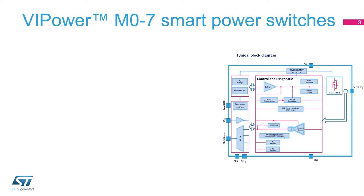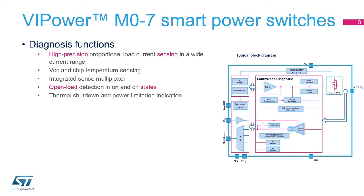The architecture of VIPower M07 high-side drivers is common to all devices of the portfolio and includes single, dual, and quad-channel products. A control and diagnostic block embeds a driver for the active power MOS, a current sensing circuit that provides a diagnostic current proportional to the load current, a feedback signal proportional to the device's junction temperature, and a feedback signal proportional to VCC voltage. All three of these signals can be selected by an integrated sense multiplexer and put on a single diagnostic output pin.